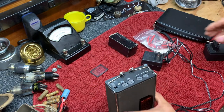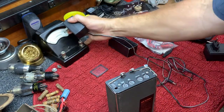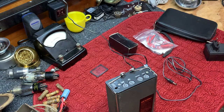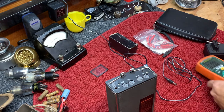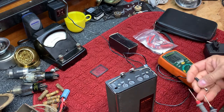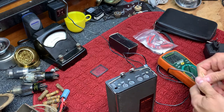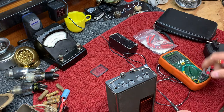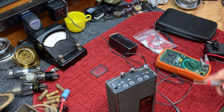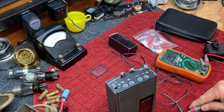Let's plug it in. First thing you've got to do with these adapters is double-check that they are actually working. I've discovered over the years that some of these adapters are no good — you plug it in, can't get anything to work, and just assume the adapter is fine. So we're not worried about polarity for the moment. Let's just double check. Okay, so 15 volts, almost 16 volts with no load.